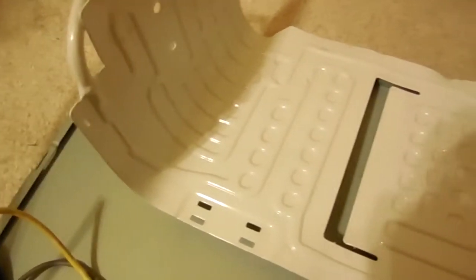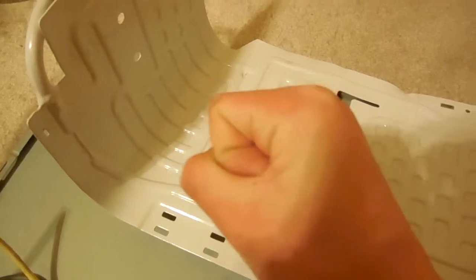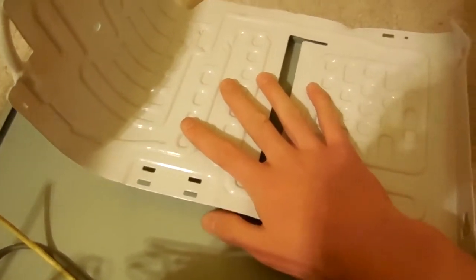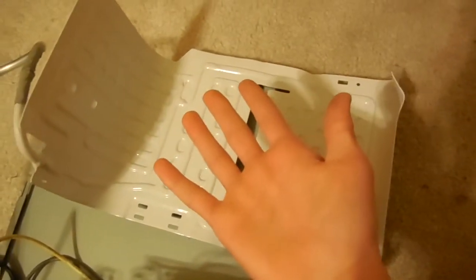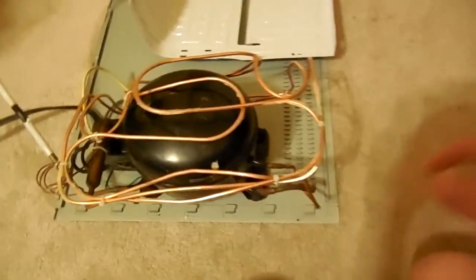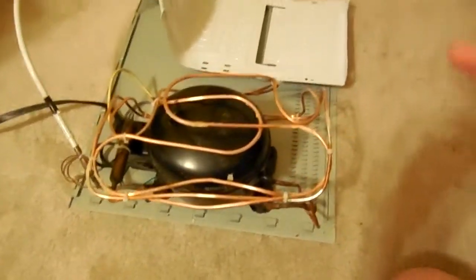low pressure area. And when it comes out to the low pressure area, since all that gas, which was squeezed into a very small area, and its heat was taken away, was radiated off in these coils, now once it expands, there's very little heat in it, and so it gets really cold over here, because it's absorbing heat from the air. And if you touch it, it's absorbing heat from your hands, so it has sucked up a bunch of heat. And then it makes its way back into the compressor, and it compresses it down again, and so all that heat is back into that small area where it can radiate out again.